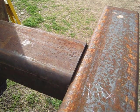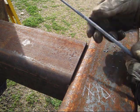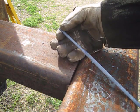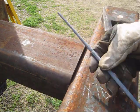Okay, I'm gonna give you some Texas TIG lessons real quick. This is something I really hadn't discussed, but it's something I run into all the time. Now, I've got a good friend that donated these rods to me. These are 8010s. I think these are 5/32nd. They're pretty big, but they got wet. As you can see, the flux is coming off of them.